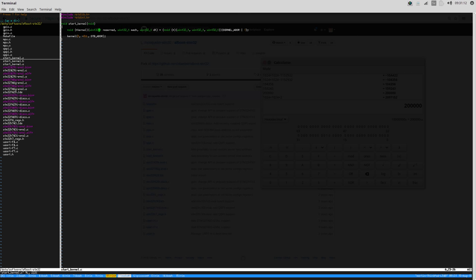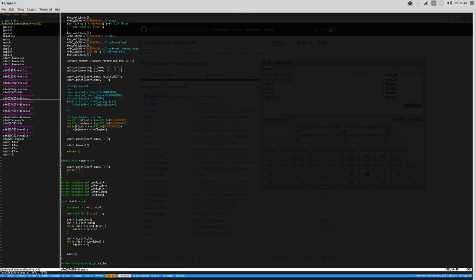In this case the address is going to be 0x08008000, which is where our flat kernel binary is going to be placed in flash. When the Linux kernel starts it already expects the RAM to be initialized, so that's why you need something like this to do the low-level initialization. It's actually very good because if you want, you can copy the kernel into the RAM and run it from RAM as well.